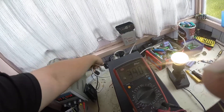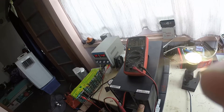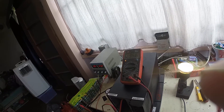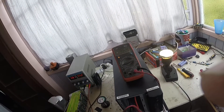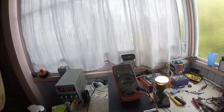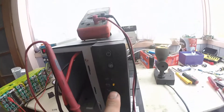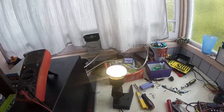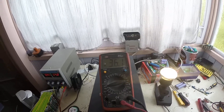Let's unplug it at 40 volts. So when it's above 36 volts it lets you kill the alarm — below that it's telling you the battery is going flat. The battery light's not flashing this time. It's quite happily running that 100 watt resistive load. We've got 36.1 volts.